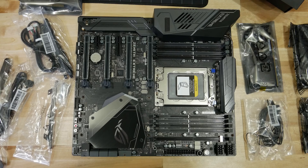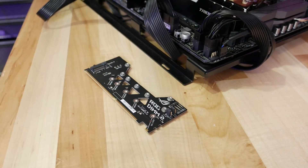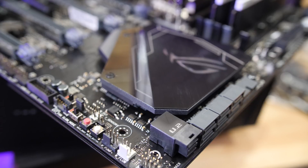Also featured on this motherboard is the DIMM.2 slot — an ASUS-unique feature. DIMM.2 is a connection mechanism for two M.2 devices on this motherboard. You install the M.2 devices on a daughter card that vertically raises them off the motherboard, improving airflow so those M.2s run cooler. The interface goes through a memory-looking slot but is actually a PCI Express interface. I really like this approach. There is another M.2 underneath the chipset with a mixed plastic and metallic ROG aesthetic finish.